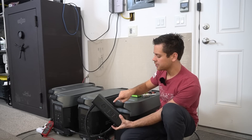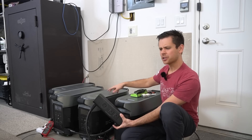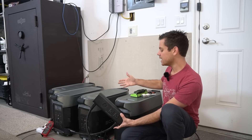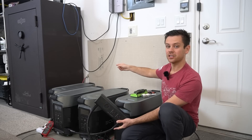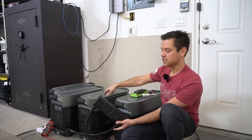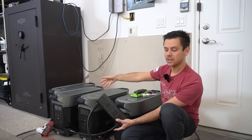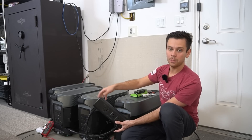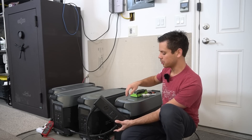I figured this out because when I had the 240-volt hub on I couldn't charge these units, so I realized it must be using a bi-directional inverter circuit — it can either charge or discharge. When I connected solar I realized that's a separate circuit, completely different from the AC charger. Both units still have working MPPT, and the inverter circuit on both can output 240 volts, but the AC charger on one is completely broken.